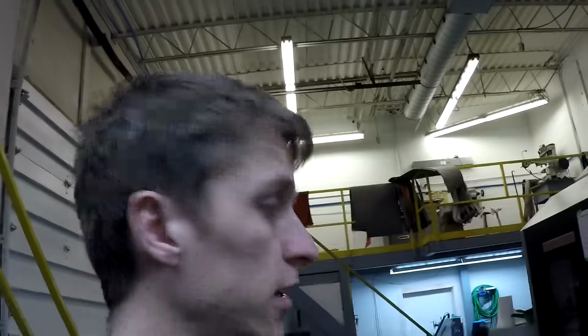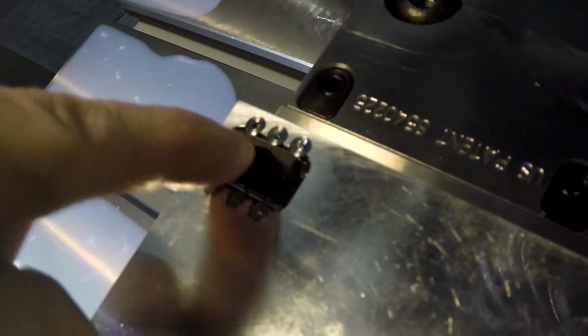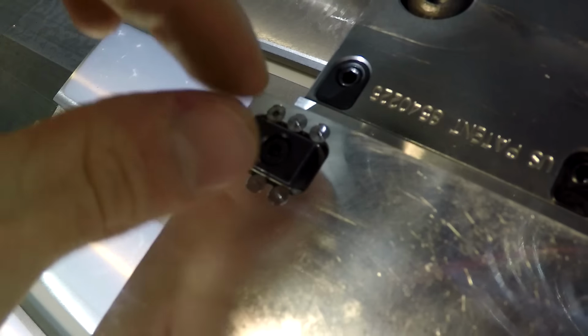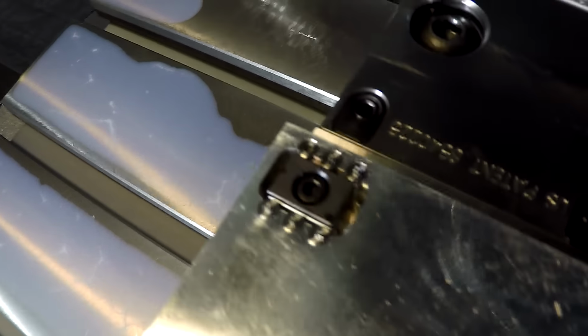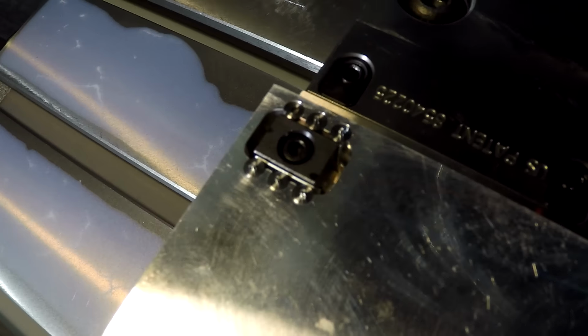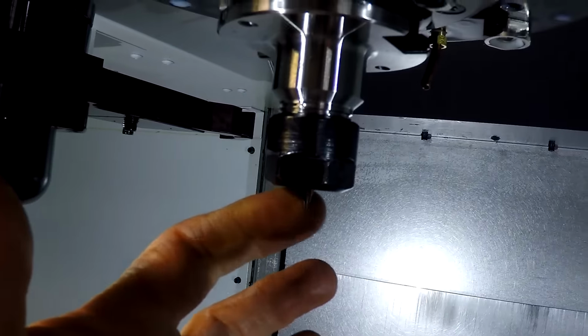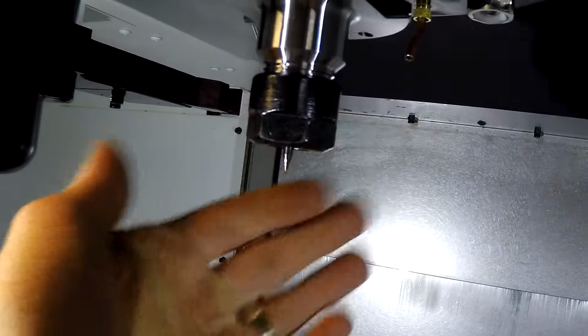Let me show you the fixture that I made to machine the Torx pattern in the top. So I had a scrap fixture here. What this is, a Mighty Bite Uniforce clamp that, as you tighten the screw, the clamp expands. And it's holding down six at a time. Except, I broke the end mill. It should work, the fixture should work just fine. But it's this little tiny tool that is broken and gone now, missing, that is not working.